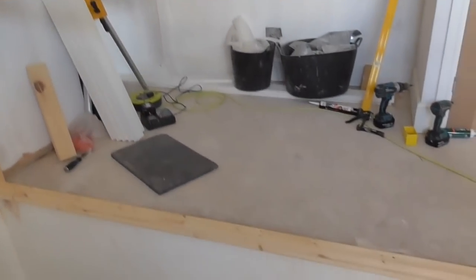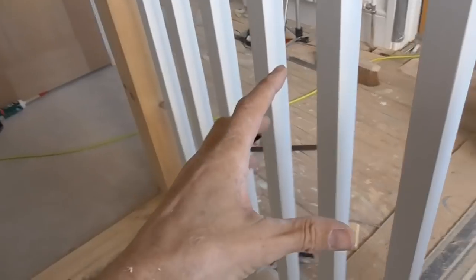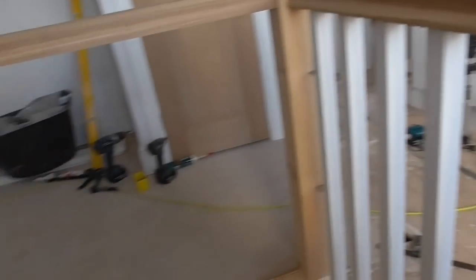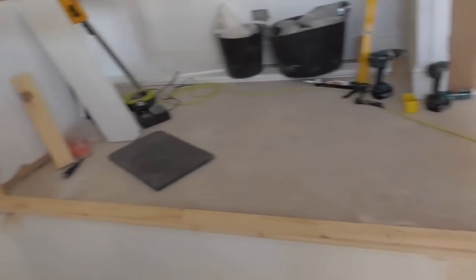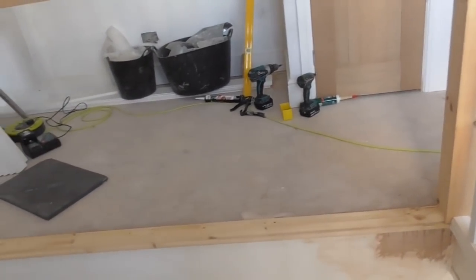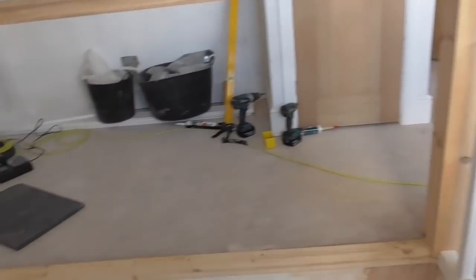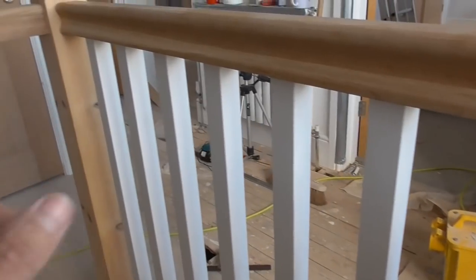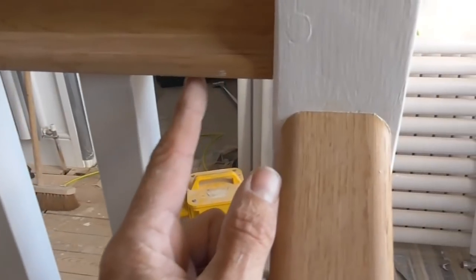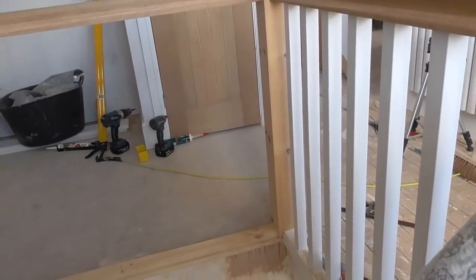Because this is a bit of an add-on with some work already done on it, we've got a gauge to go to already. We want these ones to match but with a nice equal gap all the way along. There are 18 spindles going in here, so we've got enough that we can adjust the gauge by a couple of millimeters to get it to fit exactly. With a much smaller run you might have more difficulty and may have to keep an unequal gap at each end. But on longer runs like this you can gauge it out and get it more or less perfect.